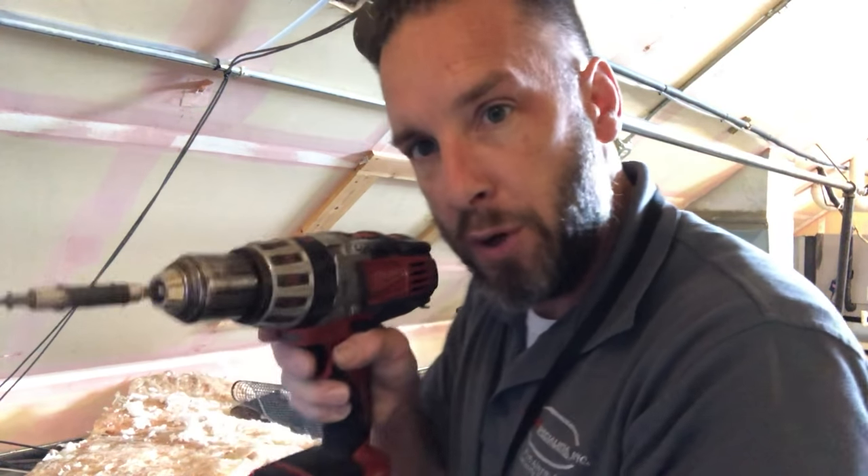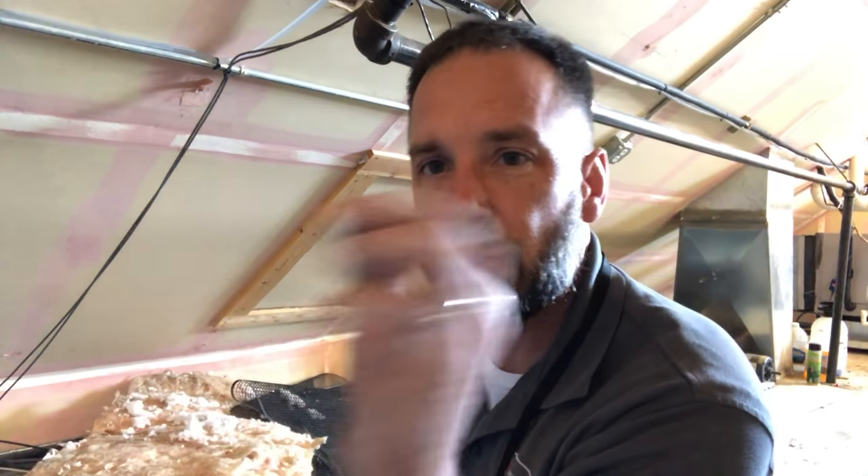The key to drilling with these is the pressure you're going to use with your drill. Any time you're drilling, you should put pretty constant pressure so that you're not slipping out of the socket area. If it's a Phillips, you want the Phillips to be in there. If you're not putting enough pressure, it starts to pop out and it'll strip the head of your screw.